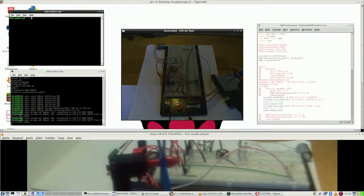Welcome to another video on my Raspberry Pi 1 using a Raspberry Pi camera and a webcam. Last time I decided not to use the XS motor from fischertechnik, which you can see here and here, but to focus a bit on pulse width modulation, software side, with these two coupled. Well, this one is out of the picture for the moment because this one is only applicable when powered, and I have taken the power off this hardware pulse width modulation circuit for the time being.